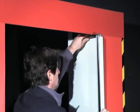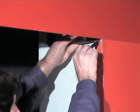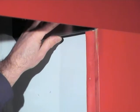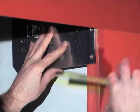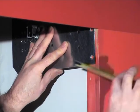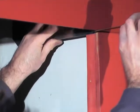In case of overlapping tracks as displayed on the screen, the side panel must be installed after the tracks for the vertical position, and then set 9mm back from your header for the horizontal position. If you have chosen the standard tracks, you just need to position the side panel in the track grooves provided.